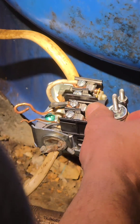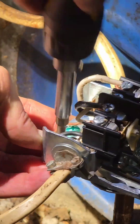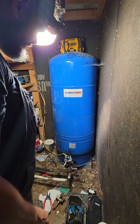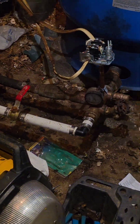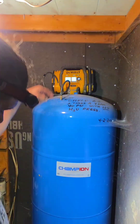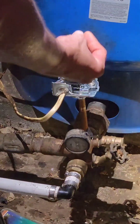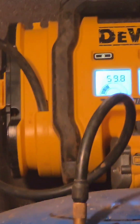White white, black black. We got a new pressure switch, we put the appropriate amount of air in the pressure tank — 38 psi. Pump is on. We're just going to watch it build pressure, and that brand new pressure switch should open contacts at 60. Really close to 60 now — watch these contacts right here. The contacts are going to open up any second — boom! That's a brand new pressure switch reading beautifully correctly, opened up because it reached 60 psi.